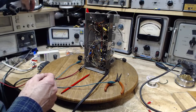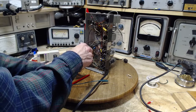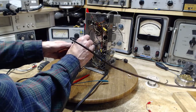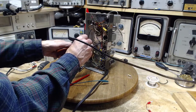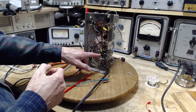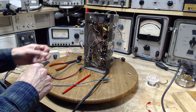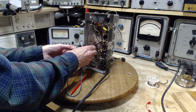You know what? I'm going to pull that little resistor out of there. I'm going to wear the tubes out on this radio. I've chased around hums before I couldn't find, and one of them I remember turned into a bad rivet in a similar situation maybe to this. I should be able to flex the rivet and get some kind of action, but how do you flex, you know, these tube sockets? That's a toughie. Okay, we're going to put it on. It's easier to take it off than it is to put it on, so we'll put it on now.